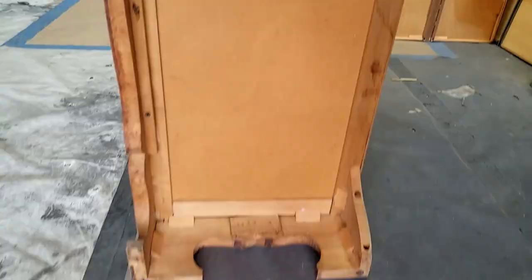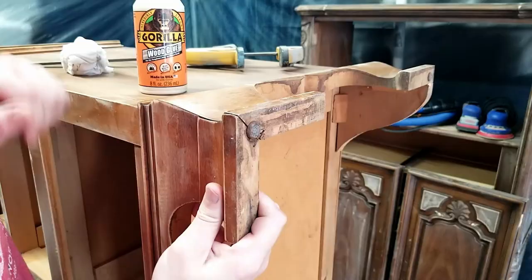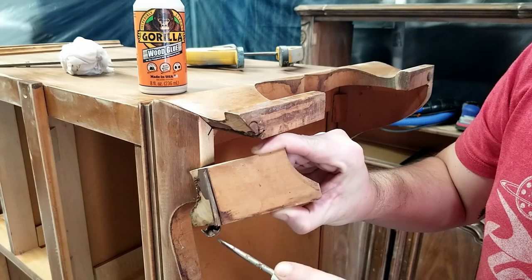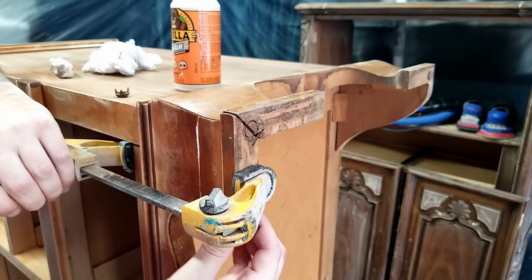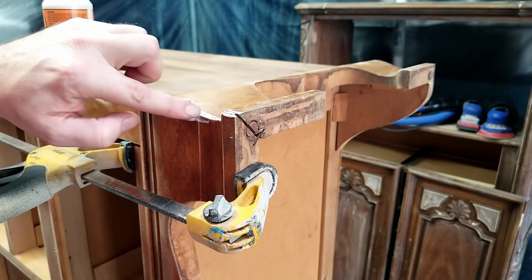With the spider nightmare taken care of I can finally focus on repairing this leg. The only thing holding it together was this furniture glide which I popped off using a screwdriver. These two pieces of wood were joined together with a metal bracket so all I really needed to do was reinsert this. I cleaned it off using the screwdriver, then applied wood glue to all of the surfaces, put it back together, clamped it down, cleaned it up, and then gave it a few hours to dry. There was still a small gap in the joint so I applied some wood glue there too. Whenever I'm working with wood glue I keep a damp rag nearby so I can do some quick easy cleanups and not have to worry about trying to sand it off later after it's dried.